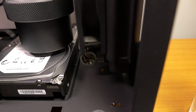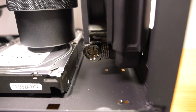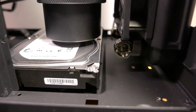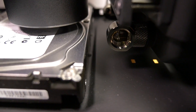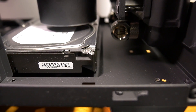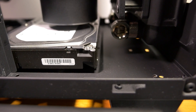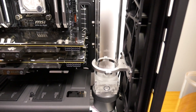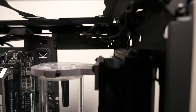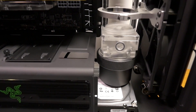Now let's talk about radiator thickness — it's a very important topic and I've had a lot of questions about it because this case is a popular case. This radiator is 30mm thick and with the hard drive installed, I couldn't install it in a push configuration with the fans because the fittings were touching the hard drive and there wasn't enough space — the fittings are down below the level of the hard drive. Without the hard drive, this wouldn't be a problem. But with the hard drive installed, you need to install your front radiator in a pull configuration. With 30mm, you don't get much thinner than that. I now have a good 15mm gap between the fittings and the hard drive, so I could install a 40 or even a 45mm thick radiator. But then there are other things to consider, such as the top radiator and the main restriction where the two radiators meet in the corner.